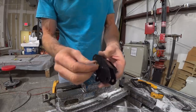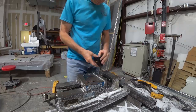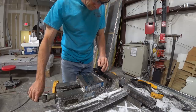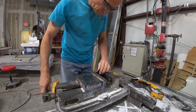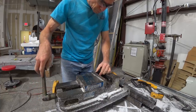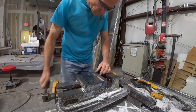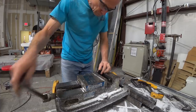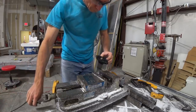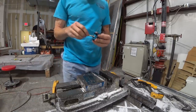Here I'm pressing bronze bushings into the actuator for the elevator — this is the actuator that lives on the front center section of the forward spar. The holes were 3/8-inch diameter, matching the bushings, but even after reaming the holes the bushings were really snug and just wouldn't push in by hand. So I used the vise like a press and pressed them into place, one on either side. That's sorted now so I can put the hardware through.